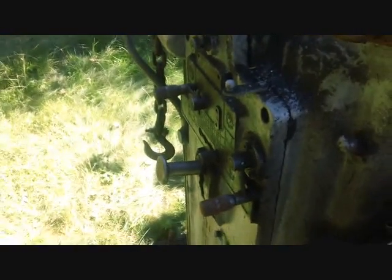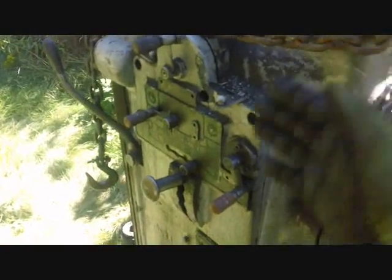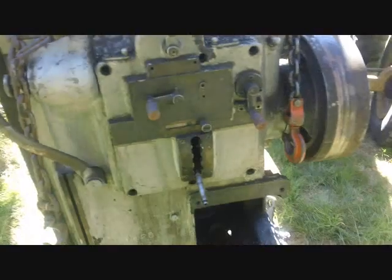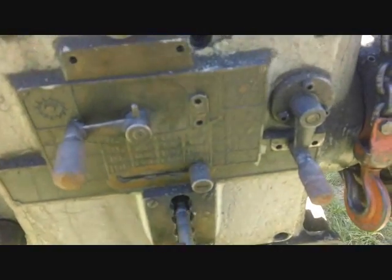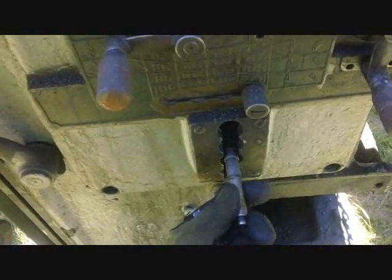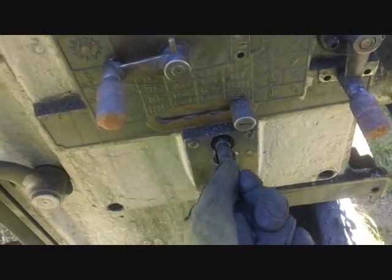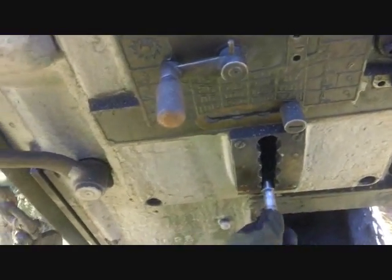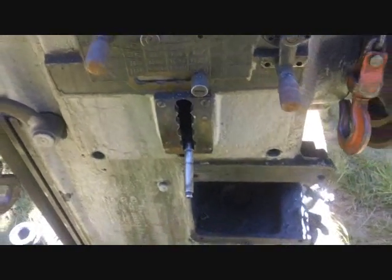I'm definitely getting some separation here. I've taken out that last screw and I'm going to put my chain hook on there to keep it from just falling out. It's not coming easily, so I decided to take off this handle — it's basically a cap, a spring, and a screw. This handle is spring loaded, so you could pull it out to unlock it and get it into whatever detent you want, just in case this lever is supposed to stay behind and that's what's holding it up.